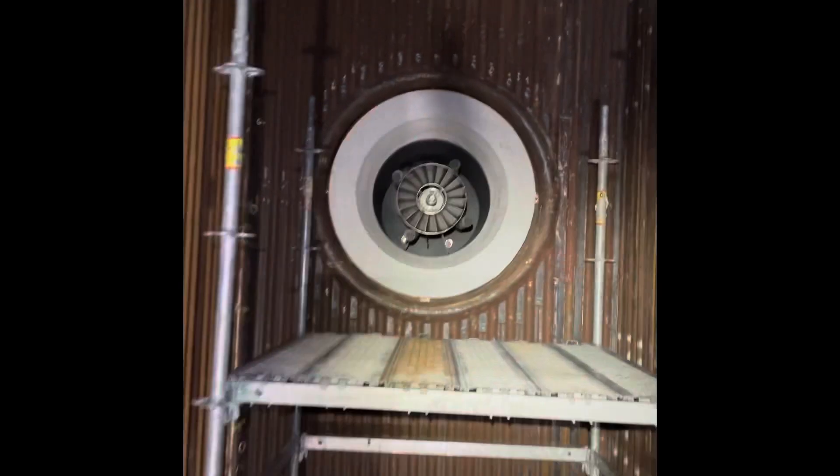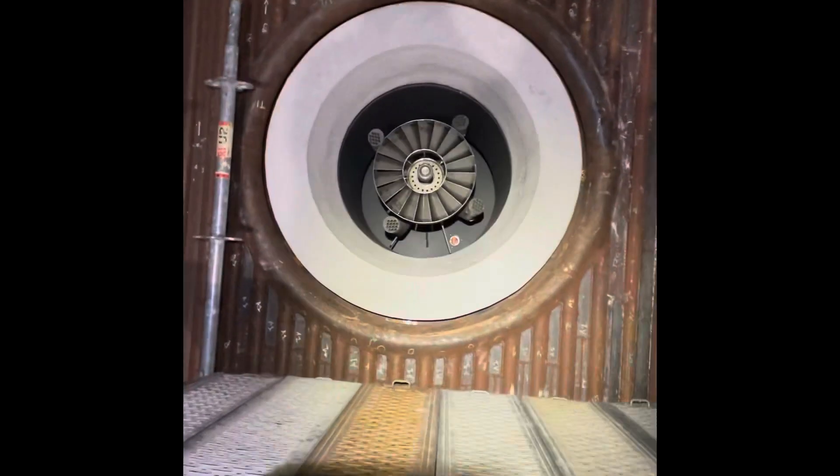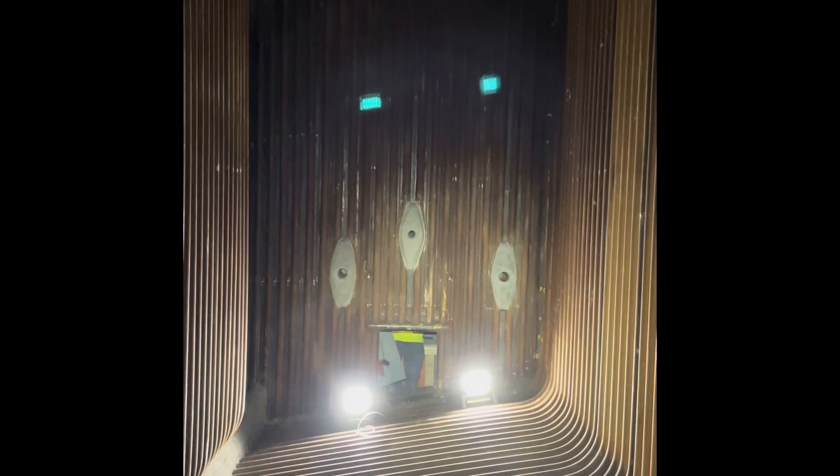This is just a quick shot of some of the furnace tubes. Now this is a membrane wall style. There's the burner, and here are those tubes. You'll see right here there's a seal welded membrane in between the tubes. So tangential tubes — the tubes are rolled next to each other. But with the membrane style, the center between the tubes is actually seal welded, so it's good to check those and make sure there's no possibility of CO short circuiting.